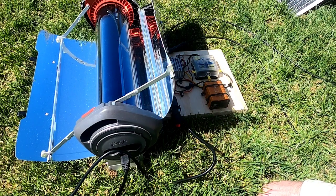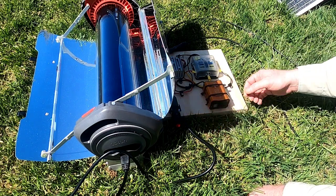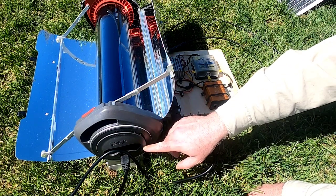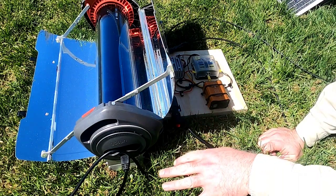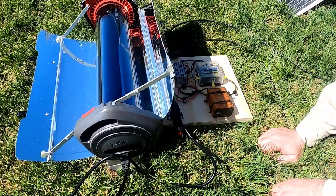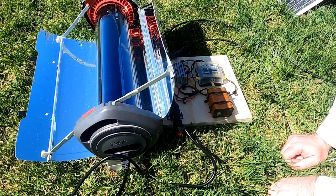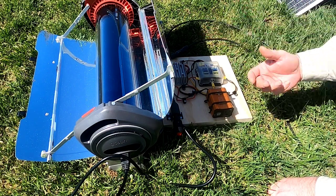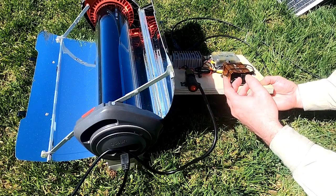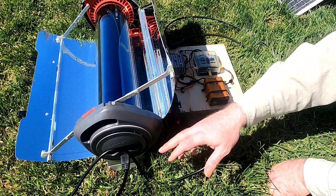I know that this 175-watt solar panel should be putting out about 130 to 140 watts, which is very close to the maximum consumption I'm going to be able to input into the heating element through the cigarette lighter adapter. So I'm expecting this is already working at full power from the battery-less solar generator hooked up to the solar panels. I believe there's about 10 to 11 amps flowing through these wires and into this element right now.